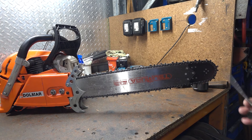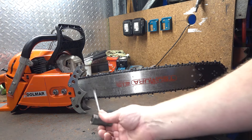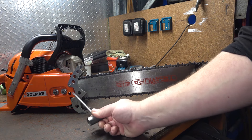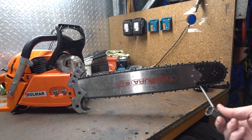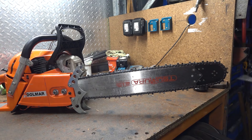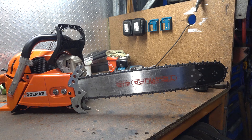This is different on every saw. The 288 clone I've got has the bar studs mounted closer to the front of the saw and different shaped spikes on the front. When this bar's on that, it's actually about 520mm — about 70mm more usable bar on that saw. It's going to be different on every saw depending on what you use.